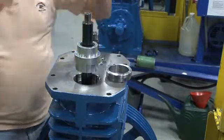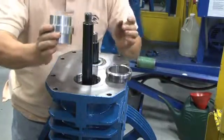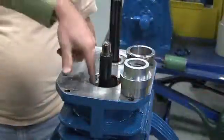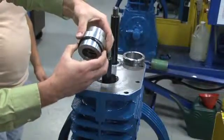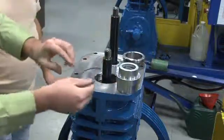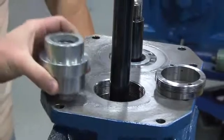Note: if the packing box does not lift by rotating the flywheel, simply grasp the packing box with your hand and use a twisting motion from left to right while pulling up on the packing box. After removing the packing boxes, use your finger to remove the O-ring that sits underneath the packing box. On double-packed versions — LB602 and HD602 — a second O-ring will be at the bottom of the packing box. This O-ring typically will not come out with the packing box and must be removed with an O-ring pick or narrow slot screwdriver. Now it's time to replace the packing inside the packing box.